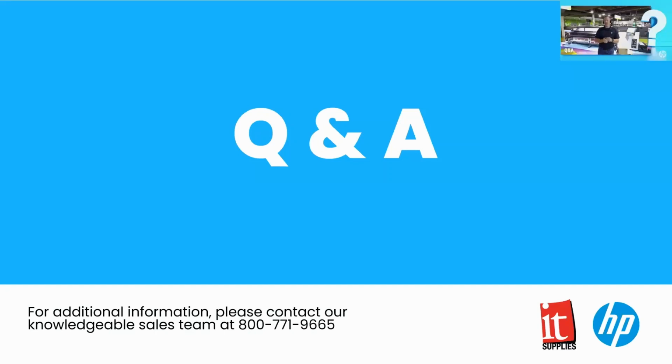Yes, but this is a loaded question. Okay. The pigments won't fade. We won't have the same issue as the timeline of dye printed flags. But the ink is on the surface versus dyed into the fabric. So if ink is on the surface, just like UV, just like solvent, just like latex, it's not embedded into the polyester, then with weather and with whipping in the wind, you can start to abrade that ink off.